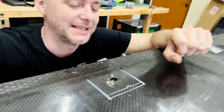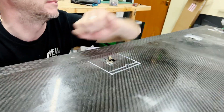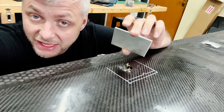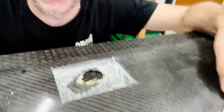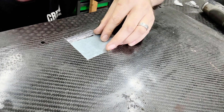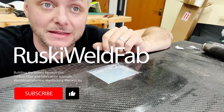There are a number of ways to fix this. The easiest way is literally to put more carbon on top and try to secure it again, but that's not a permanent solution in my opinion. So what we're going to do instead is insert this 4mm aluminum plate on the inside. Being fairly light, you can drill it and countersink it if you want — the bolt goes around the edge so there's no need to use a washer. I've marked the size I want and cut this bit out, so now we're basically going to glue this in place with epoxy.